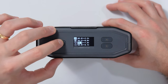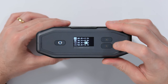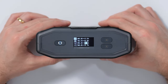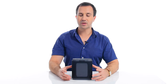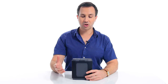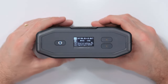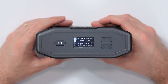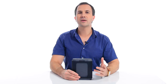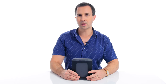Now that we've set our voltage, press the power button once again and that will take us over to our amperage. We're going to lower that down by pressing and holding to move quickly through those values. So now we've set it to 20.3 volts and three amps. Now that we've set our two values, simply press the power button once more to save the preset. To turn on one of our four presets, navigate to the preset that you want and press the power button to select it. It will give you a warning saying, do you want to set the DC output to 20.3 volts and three amps? And it gives you a warning that if you have set your voltage and amperage incorrectly, it may damage your device. So you always want to double check your values before plugging it in.